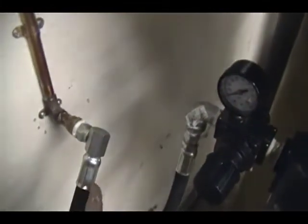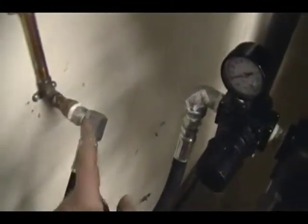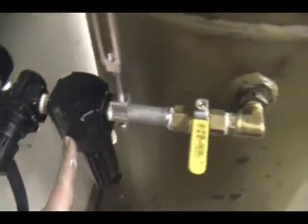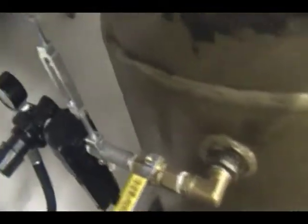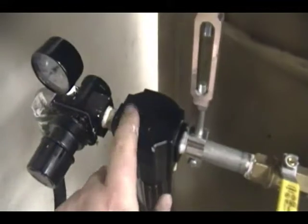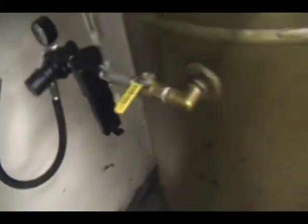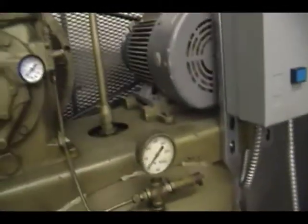I went in to put an elbow on here, which I wish I'd thought about earlier, but water over the dam. Got the regulator and water separator mounted, then a ball valve going to the tank. This bracket here is basically to support the weight of the regulator and water separator and handle any flex in that line.